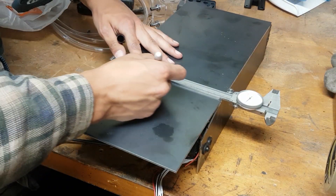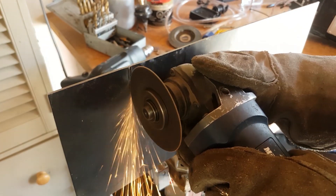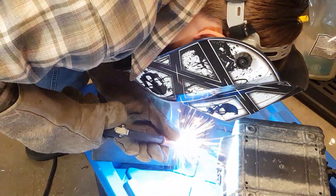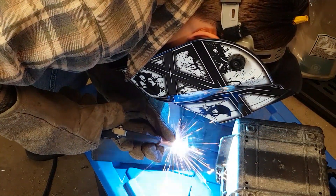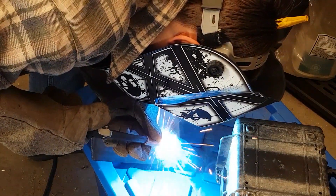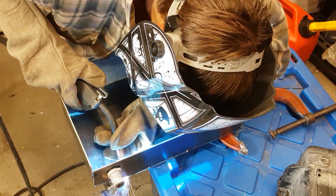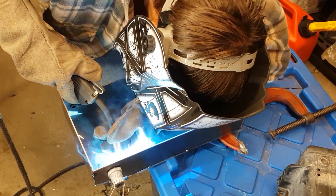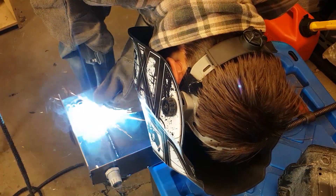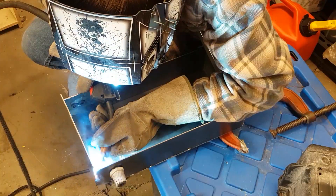The next step in the manufacture of the box was to install the bottom slash front plate. I marked the lines and angles I needed and partially cut through the plate to make it easy to bend. After I bent the plate to the required specifications, I did a full weld on the back, some partial welds in the corners on the inside of the box, welded the parts I cut to make the angles, and a full weld on the two front corners. I definitely overdid it with this one.